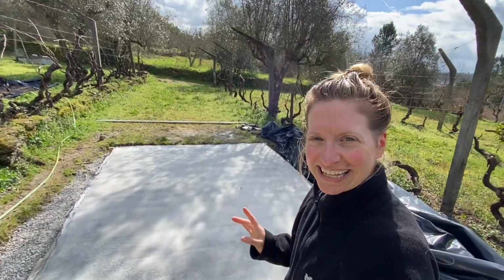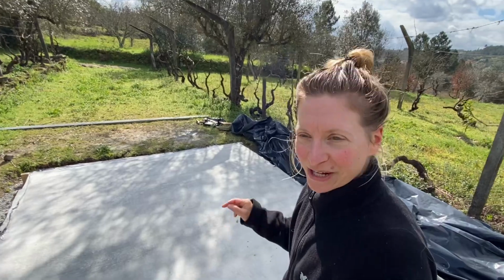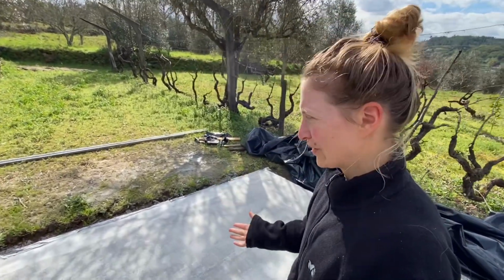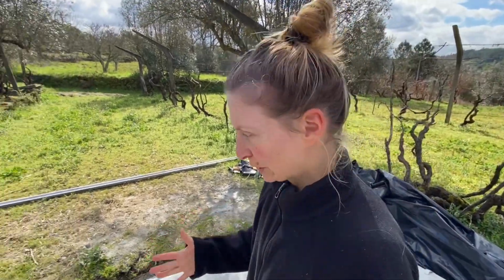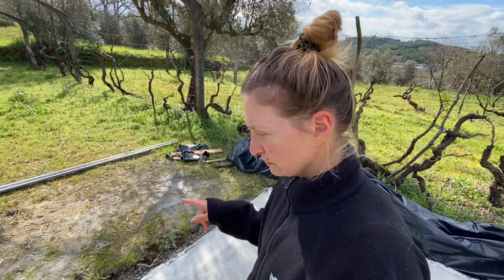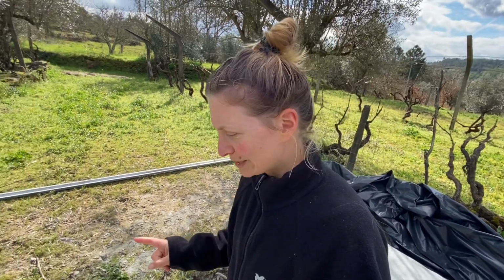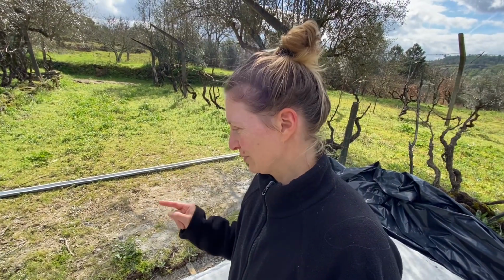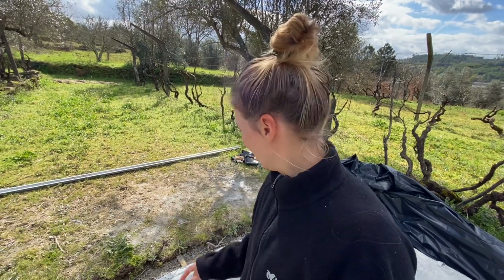So it has been exactly 1 week now since we poured the concrete, and as you can see, I can stand on it. It's almost dry, I think, at least dry enough to work on it. So what I will do now is start to disconnect the wooden form as much as possible, because I just noticed that there's actually a lot of cement on it.